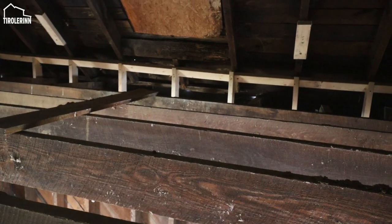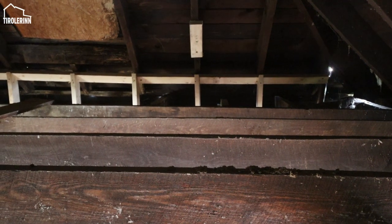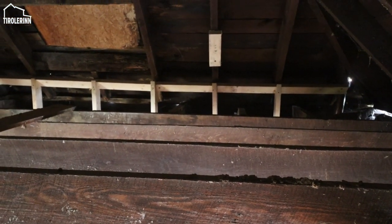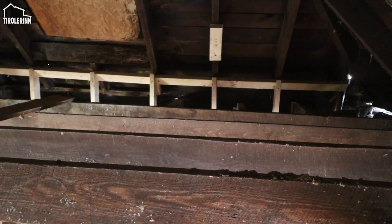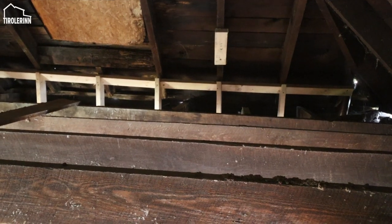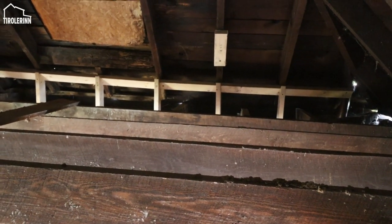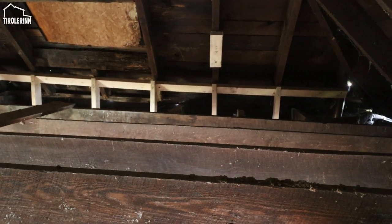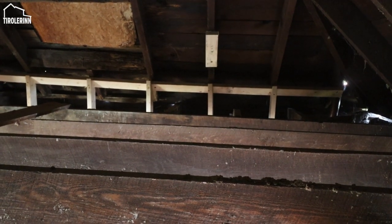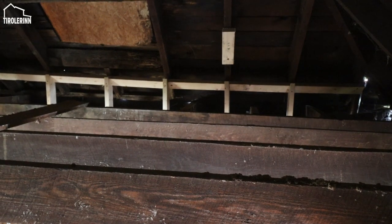How that happened is I put it all up level before I had the wall supporting it, and before I pushed out the roof where it actually needed to be. So when we increased the height of the roof, where we pushed that entire section out, that beam moved to the back, and therefore it looks like it's much further down. Obviously, it doesn't really matter if that thing is not supporting it exactly the same way.